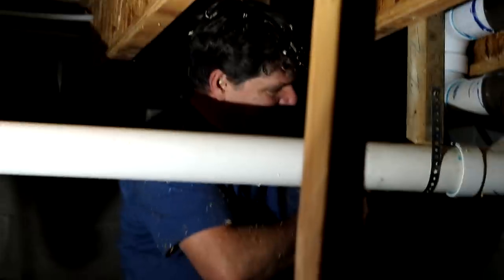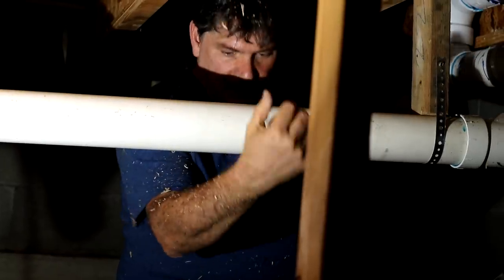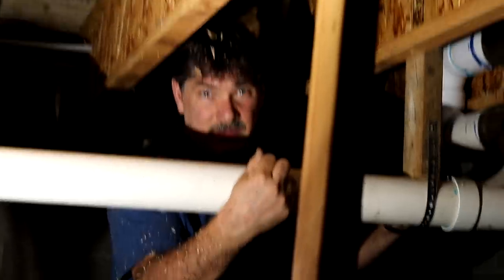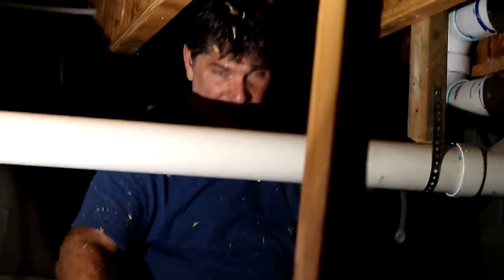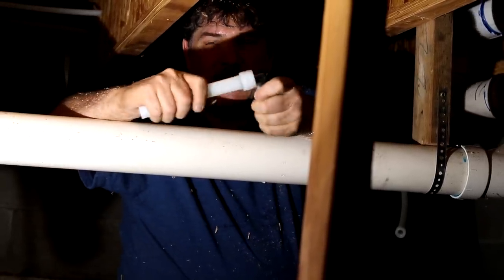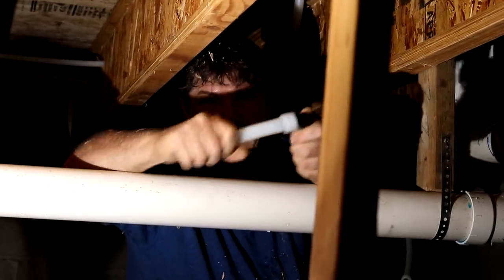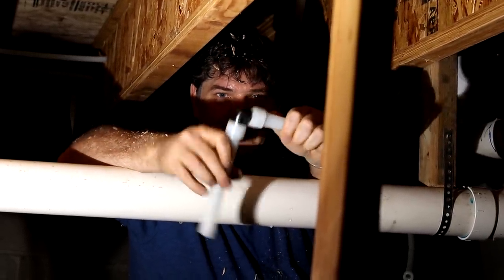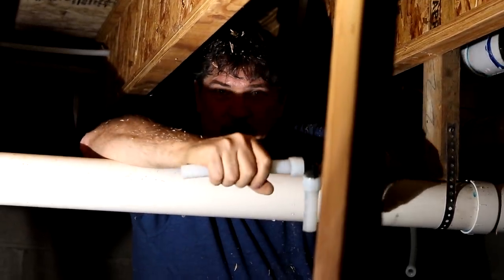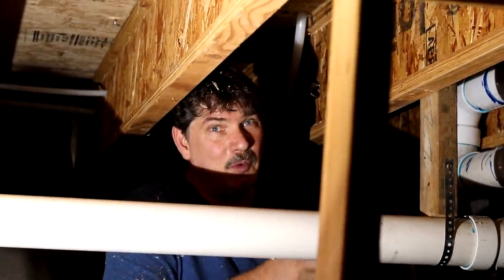That's perfect. Is there no way to save these PEX fittings, like cut them off the pipe and reuse them? Only if you want to try to get off Gilligan's Island and it's your only hope. Okay, got it. Warm them up. If you leave enough tail on it like this, you can warm that up with a heat gun and sometimes pop them off. Or first split that ring off and then you can. But if it's cut off really short, you don't have anything to pry. Sometimes $100 an hour ain't worth a $3 fitting. Sometimes you don't have any more and you need to.